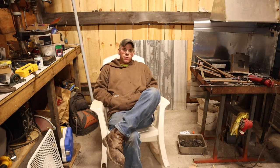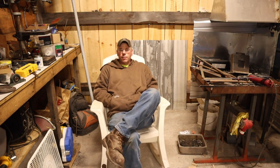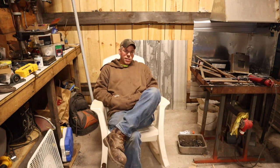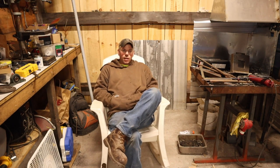That stuff I'm using is kind of a cold rod. Like I said, it's rated for 110 amps. I'm running it at 115 because that's the closest I can get to that with the welder that I have. It works with an AC welder, and it works with a DC welder. You can use either or. It's really good stuff. The flux comes off really nice and easy.